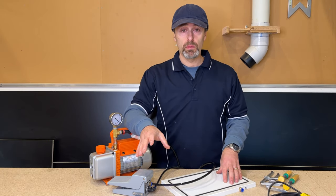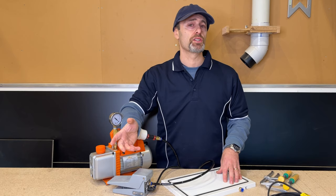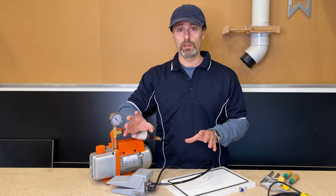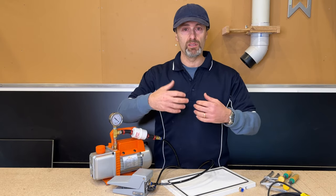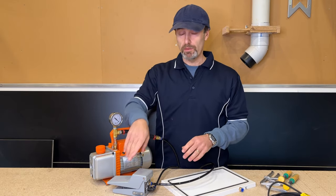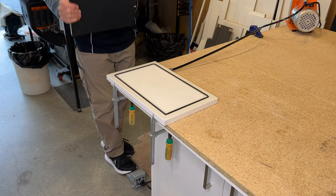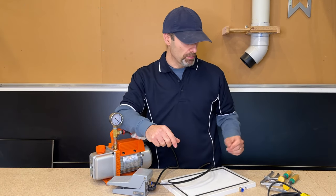So yeah, the board material, the vacuum pump, I have done a foot pump as well. The foot pump is actually optional. If you didn't want a foot pump, then you'd have to keep going backwards and forwards to your vacuum pump to turn it on and off. I found the foot pump is really convenient, especially when you're doing a job where you're constantly moving your board on and off, to router on it, or to chisel or drill on it, whatever it might be, and you're moving your board on and off the workpiece. This foot pump's going to be really, really handy, because it diverts the pressure out of here, and it comes out of the foot pump itself, and gives you access to remove your job and put it back on. As soon as you take your foot off the foot pump, you've got your vacuum again.